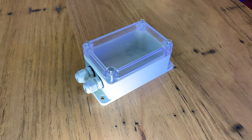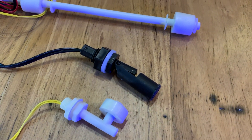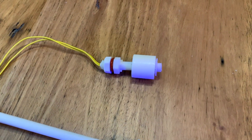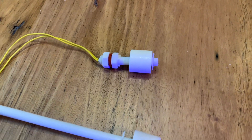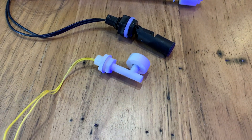Let's go through how to build it. You'll need the following things, all linked in the description below. You'll need a hobby case — preferably one that's IP66 fully waterproof. You'll need at least two float switches, though you can use more for additional redundancy. They come in a variety of shapes and sizes: long ones are great for your bottom sensor, and 90-degree ones work if you want to mount the float switch into the side of a reservoir. The cheap ones on eBay are rubbish — they provide inconsistent responses and often get stuck, so spend the extra few dollars for better quality ones.